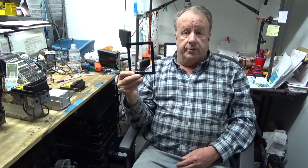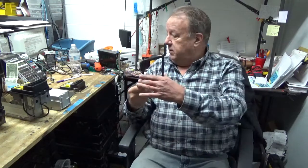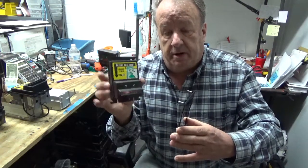If they cool, that's an awesome deal. Don't worry about the coinage, don't worry about the funky old coin mech, the old MEI validator, or maybe a Coinco — or maybe it's just a blank slot. Most single-price machines made in the 80s have a cutout for the validator. If they don't, you're still not out of luck. I see people posting in the groups asking where to mount the validator — usually in the very top right corner there's a spot. This little picture-frame mount I'm holding is just what you need — it's the front bezel for your MEI. Don't even mess with putting the Coinco in there.